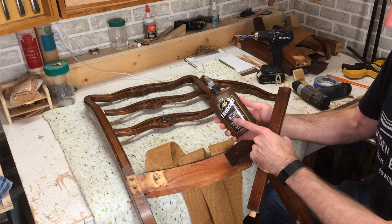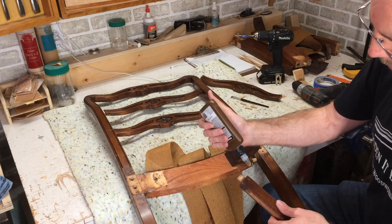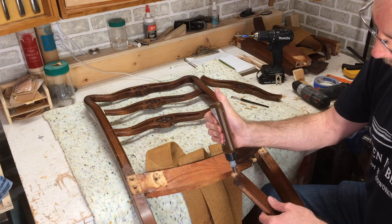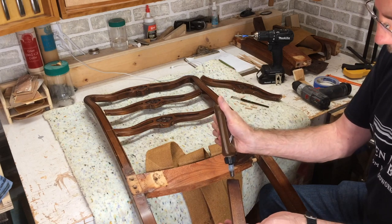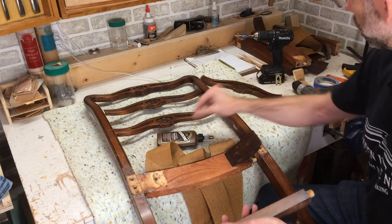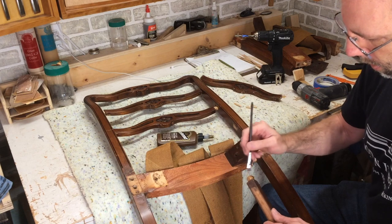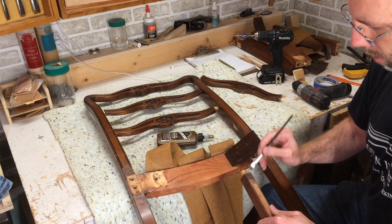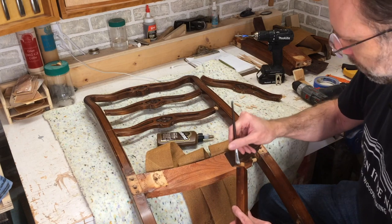I'm gluing this up with liquid hide glue, and I'm using Titebond here. There's another one called Old Brown that you can use as well, and it just saves you from having to heat up the glue and make it from glue crystals. I've got a few videos on gluing if you want to see those. I'll leave you some links in the description and you can check those out. I use right now 6 different glues in my workshop, depending on the project I'm working on.